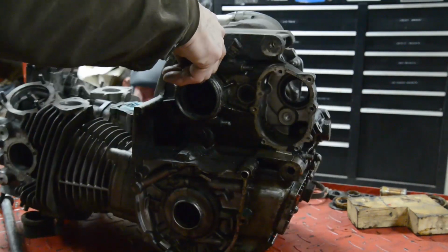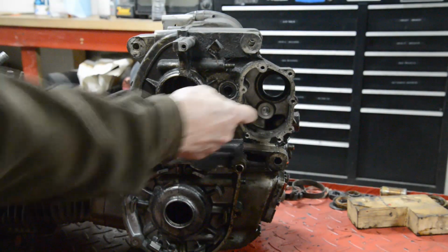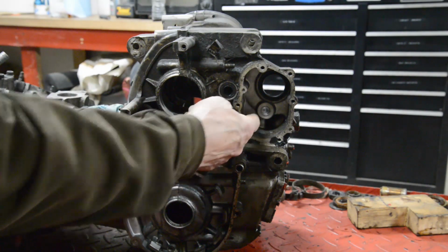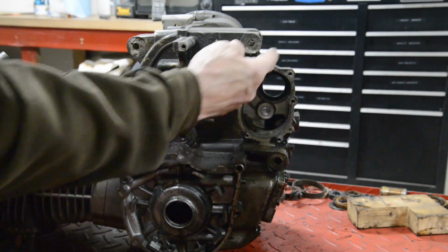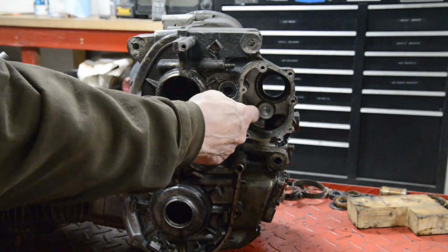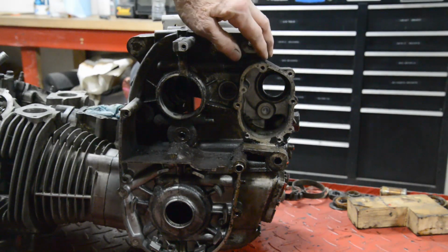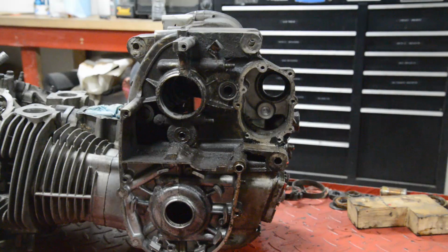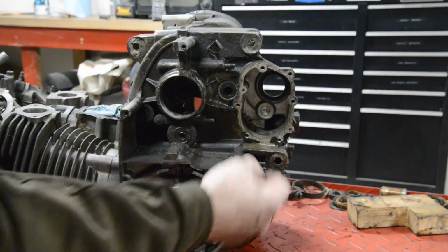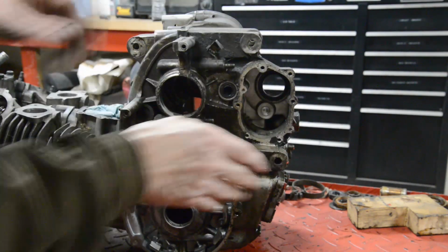and comes into here, and it drives a little gear down there. And that's all. This gear is on its own little shaft, so I can take that gear out, and with that gear out I could actually cut this whole housing off, and then we'll just weld a little piece in for the hole where the gear pokes through. If we do that, make sure you're still in view, then this comes right back to here. So there's only half the engine that's that depth, that width, that has to sort of drop down.